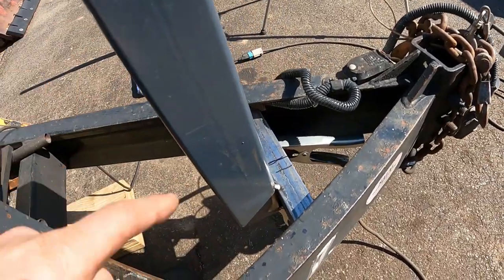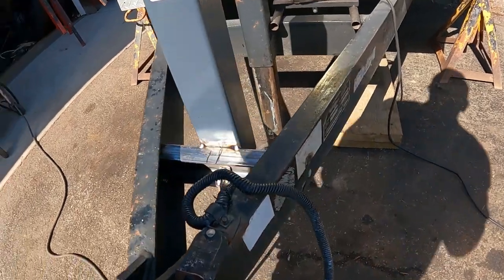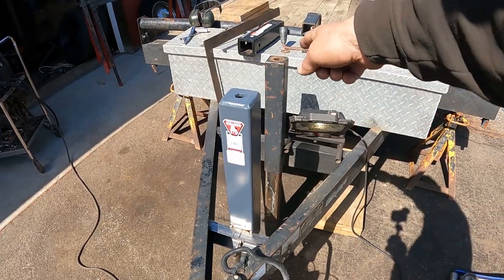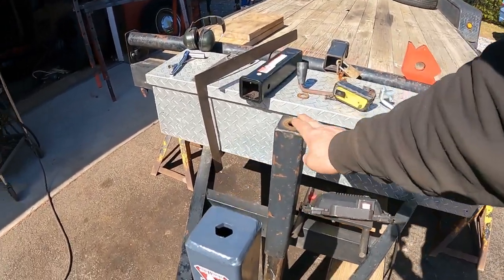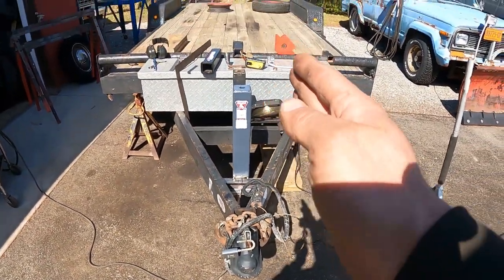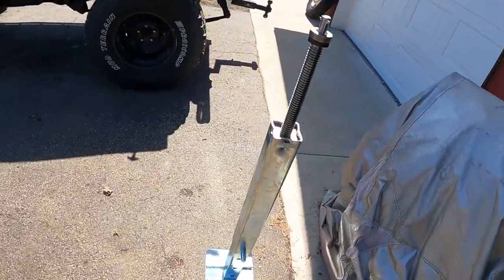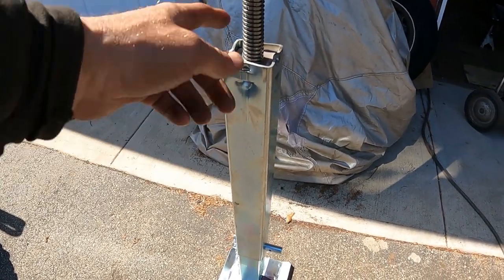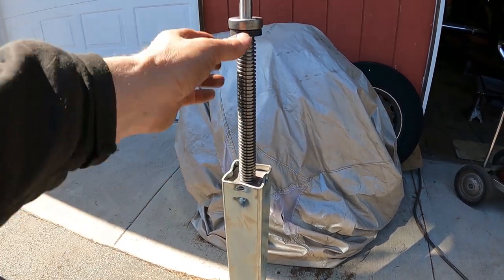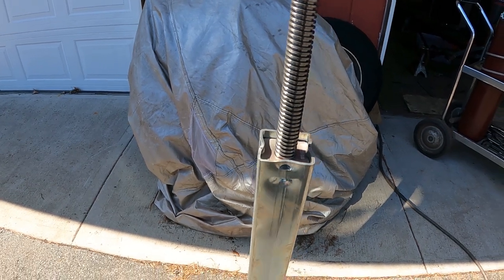I got the jack tube tacked on here. I fully welded my piece back in here all the way around. I had to get a light out because it was super hard to see welding outside in the sun — got to give credit to guys that burn every day out in the sun. The jack I think is just a little bit crooked from when they welded this trailer together, but I got this one trued up good to both side rails. It's not going to matter for what we're doing. This is the inside of the jack. There's a plate that the threads go through and very little grease on it, and this odd bearing that's barely greased just kind of floats on here. So I'm going to grease the crap out of this when I put it back together — grease all the threads, pack this bearing full of grease, and grease the whole slider tube, because that seems like a good way to get tons of corrosion with barely any grease on anything.